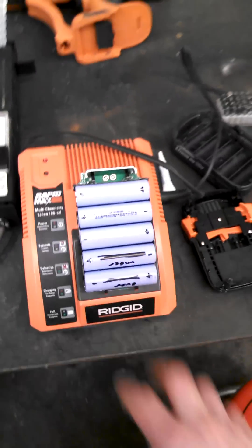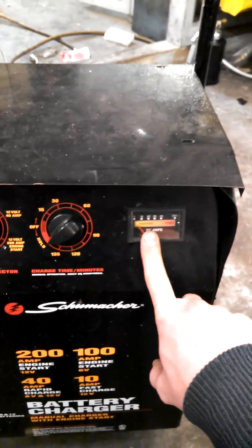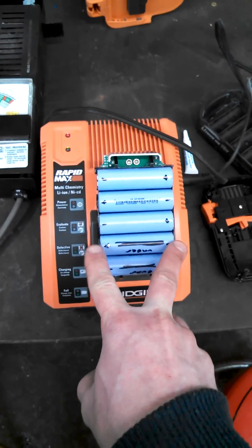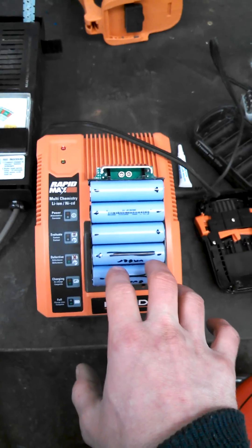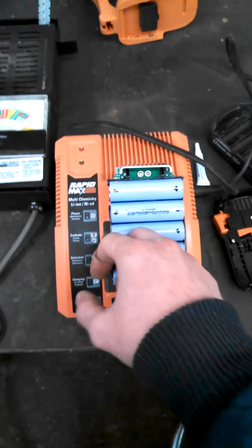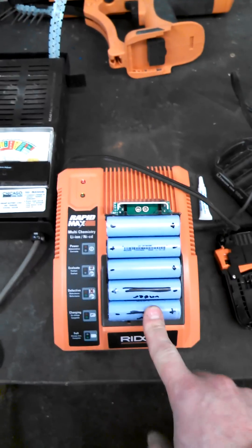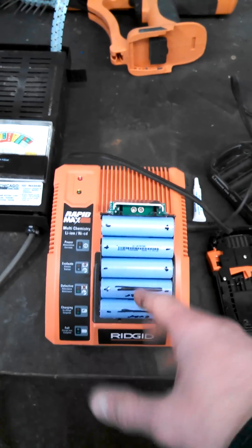As I was dumping the overcharged cell, I took my car charger, set it to 6 volts — though when I took a meter reading it was actually putting out approximately 9 volts, which is a bit high for one cell. So what I did was just tap it negative to negative, positive to positive, and give it a quick bump charge. This would heat up the batteries really quick. Meanwhile I'm discharging one cell and bump charging the other. It heated up, I disconnected everything, and tested voltages. I went up over 1 volt on the low cell and was down in the low 3s on the high one. Let it cool down and did it again — rinse and repeat until I had every cell at even voltage.